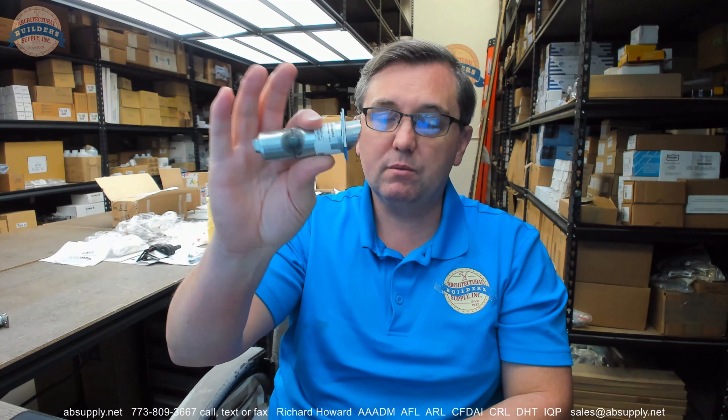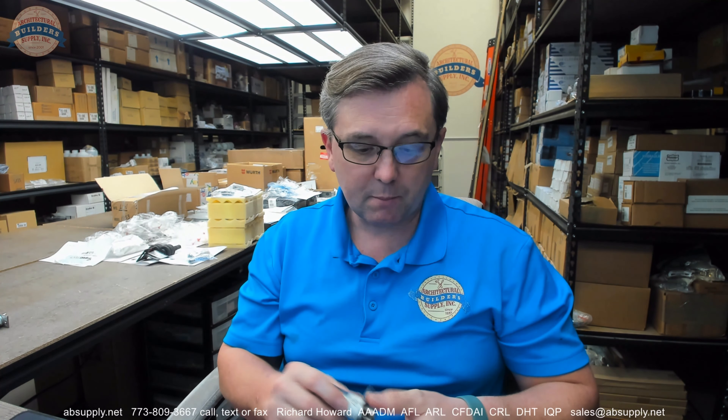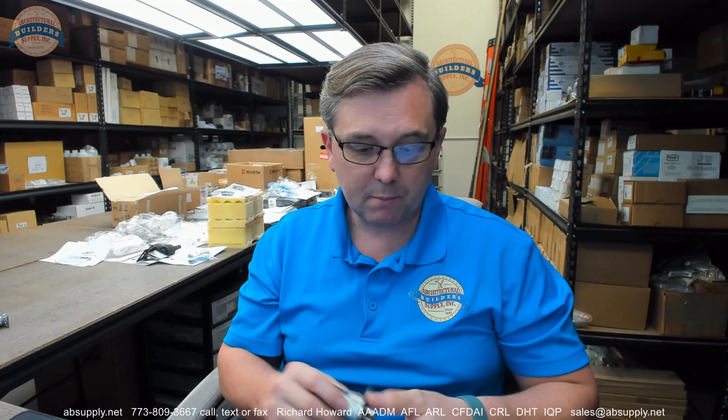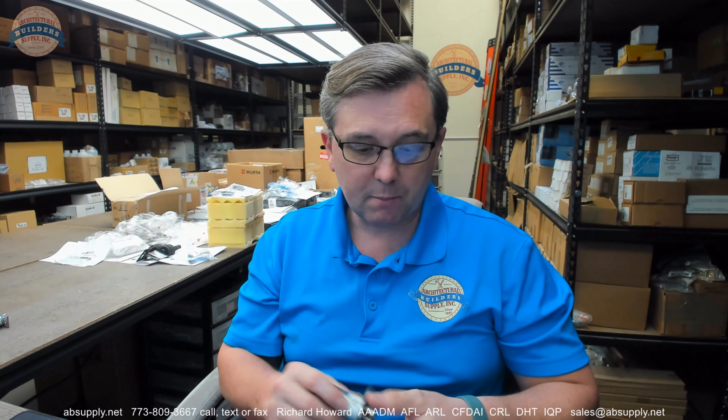Let's wrap up this video on camera. The name Yale is synonymous with lock sets, exit devices, and door closers. They do a good job and have a pretty good technical support department that I can rely on and get answers from. So if you need a 3¾ latch — the only thing I would have changed is I would have made that a floating edge. But once upon a time, doors were beveled, so a square edge door in a commercial setting wasn't really the case. Three and three quarter may have been a popular backset a few decades ago — maybe the 1960s. That's probably why you're going to see it in a beveled setting, because if someone's replacing one, it's probably a beveled edge door.